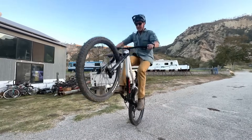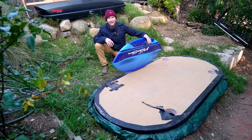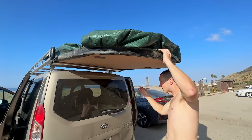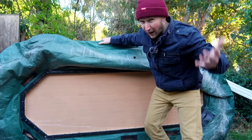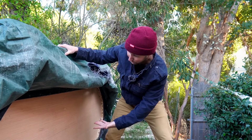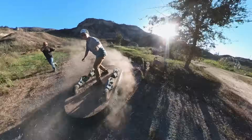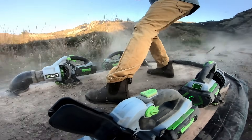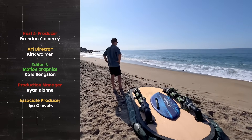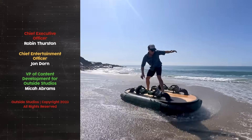A successful day. Brendan could build himself all the crafts in the world, but he'll still end up on a bike. Now we've got quite a size difference here. In considering success versus failure: the skimboard is minimalist, cheap, and easy to carry around. The hover skimboard is exactly the opposite — it's complicated, kind of expensive, and really heavy. Our lifting force is generated in pounds per square inch, so when you have a lot of pounds you also need a lot of square inches. Generating additional pressure isn't really an option because you're always going to have lots of airflow escaping — that's part of the design of a hovercraft. Did I succeed at making a viable alternative to the skimboard? Probably not. But did we make something really fun and satisfying as a DIY project? Absolutely.